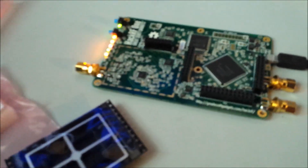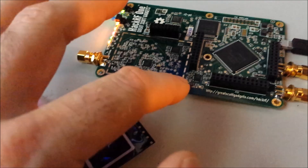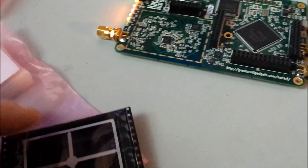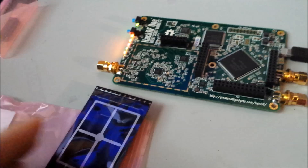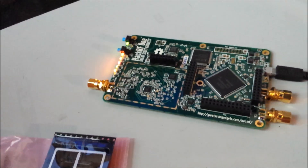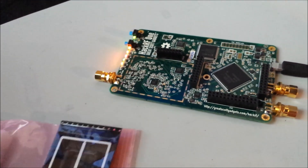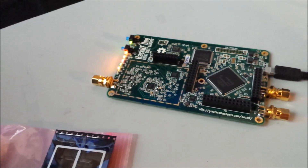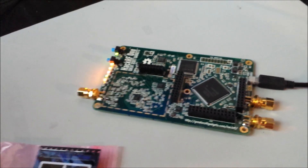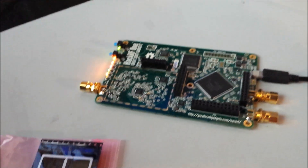There's the frame of the shield here — that's the top cap — and if you see the dashed line, that's the pads that this frame solders down to. I wanted to figure out if this shield is effective, how much does it help. The only way I could think to quantify that is to put some RF in the air and measure the difference before and after.